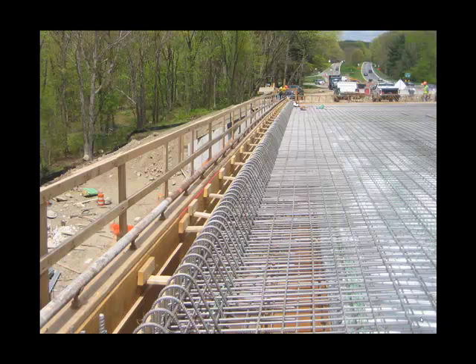The fascia form is made of wood supported on brackets. You can also see this wood handrail. On top of the fascia form, there's a screed pipe supported on adjustable screws. You need to set this pipe at a higher elevation than the finished elevation to accommodate dead load deflections. You should also use the finishing machine to make passes over the rebar and make sure you're really achieving the correct cover over the rebar.